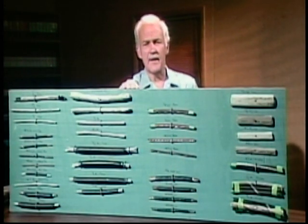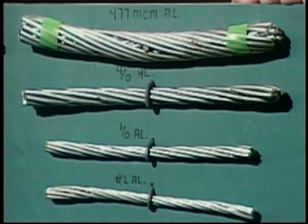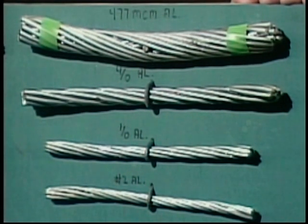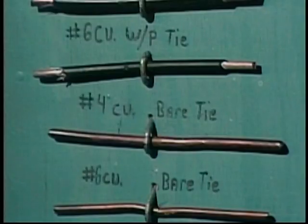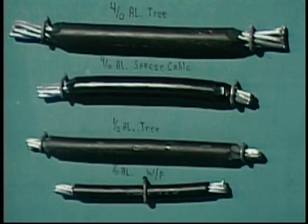The physical appearance of overhead distribution conductors is also varied. Most overhead distribution conductors are made of stranded aluminum, but in some systems they may be solid copper conductors. Most distribution conductors are bare wires; however, some may have a weatherproof covering to protect them from corrosive elements in the air or from abrasion where they pass through trees.